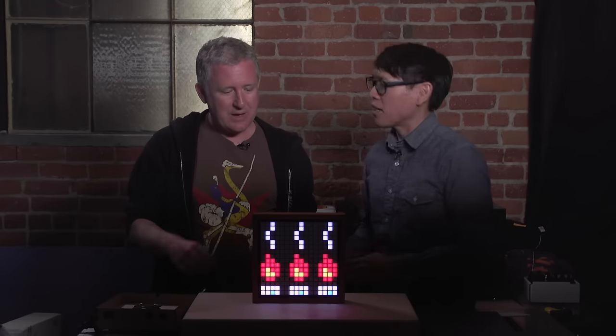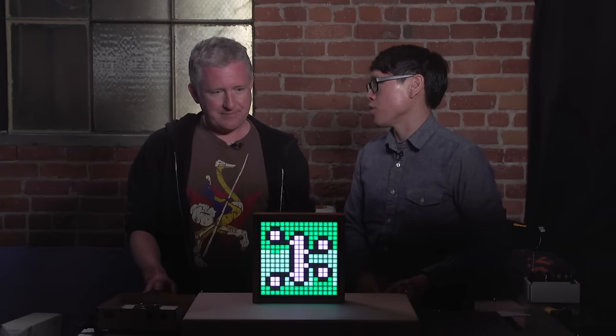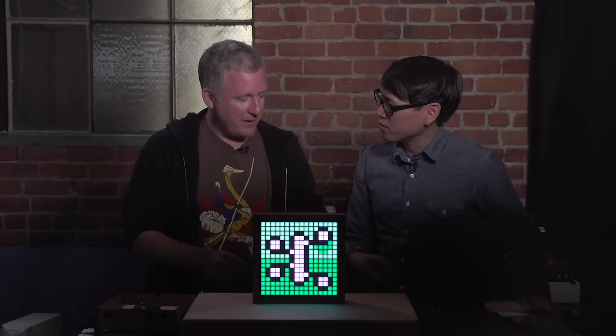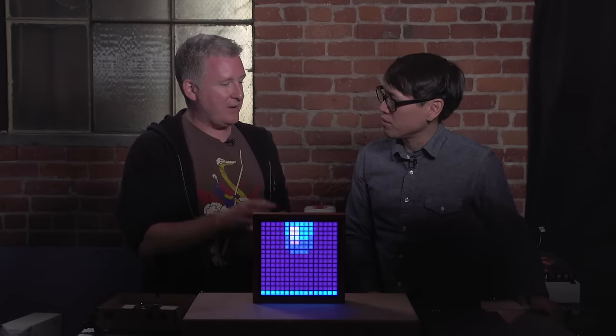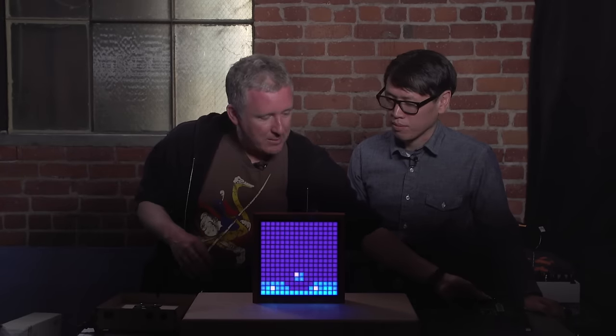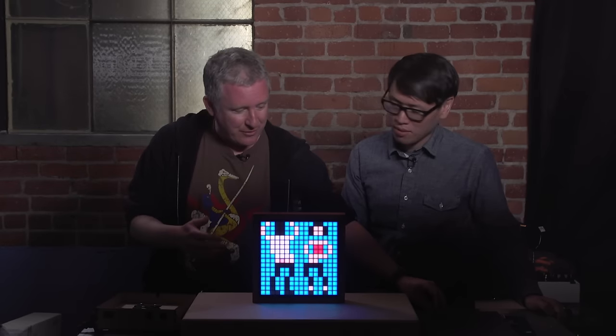You used this as a learning experience — not just for manufacturing refinement or working with the Teensy, but to do something new. The extensibility of having a removable microcontroller meant that when the Particle Photon came out with built-in Wi-Fi, I started looking at porting the Game Frame to that. It was initially difficult as the libraries weren't ported yet, but it became a reality. That's the major new advancement I'd like to reveal today: the Game Frame now runs on Particle, which gives it Wi-Fi capability.